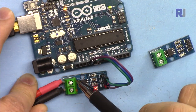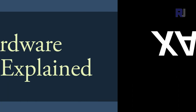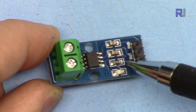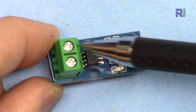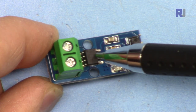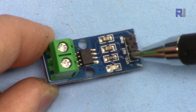We do a calculation and convert the voltage to current so we can use it for our purpose. I have written a library for Allegro current sensors which covers the majority of sensors from Allegro, and we are going to use that. This is the module - it has two terminals for measuring current. The load is connected through this and passes through the chip using Hall effect. The voltage is output from the middle pin.